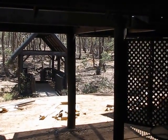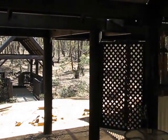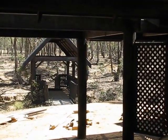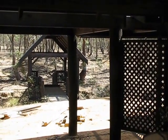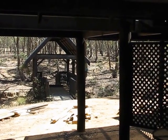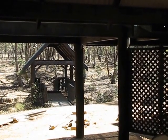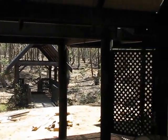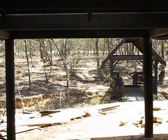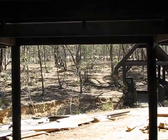Then the lateral thinking moves in, as I said. Your runouts, you will see the runouts from your poles. You might put a pole in dead square at the base, level it up with as close as you can get with a spirit level. But when you get to the top, it might be 20, 30, 40 mil out of line. Don't have a heart attack over it. If the majority of the pole is dead straight, just keep telling yourself that when you stick your laser level on, or whatever you're using to level, and you cut the tops off, you have a dead flat platform to do the rest of the orthodox build above. So you'll have a nice looking, nice square flat roof.